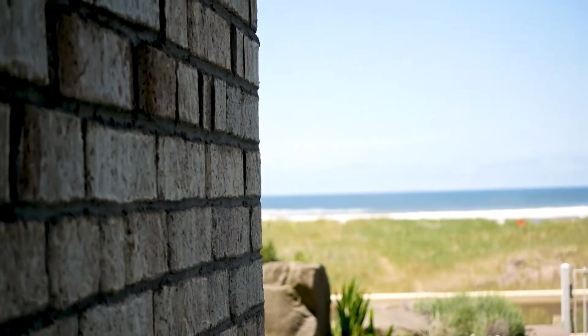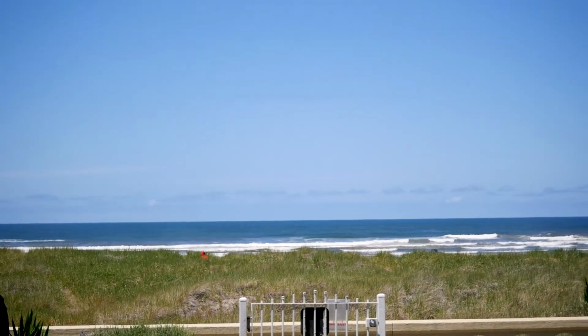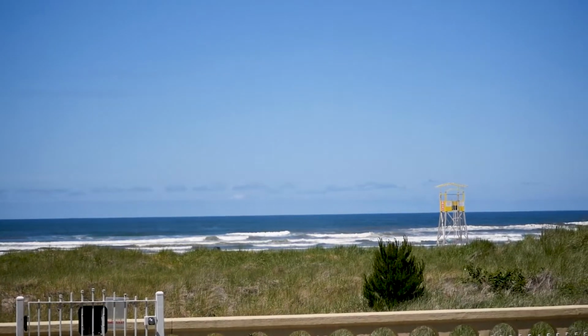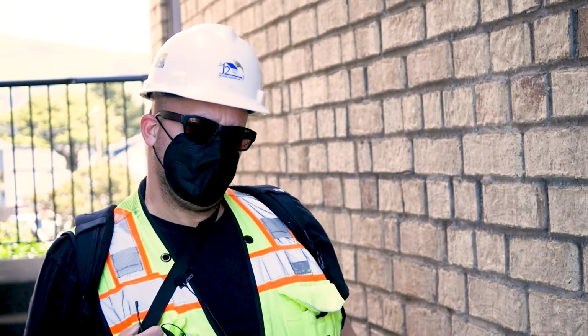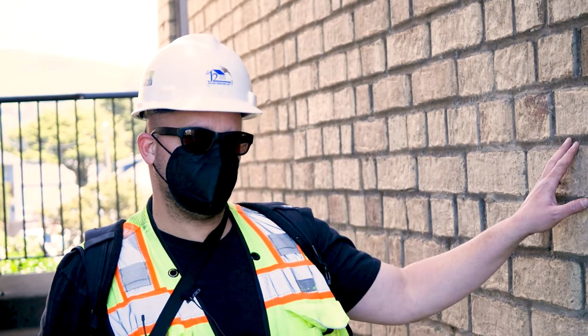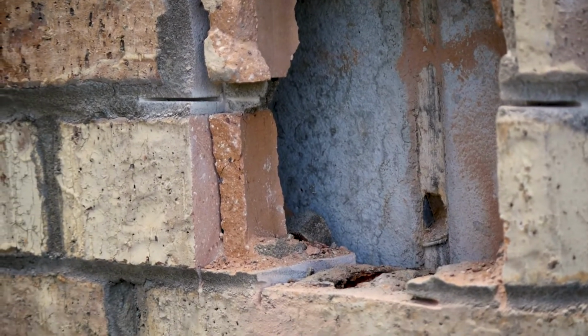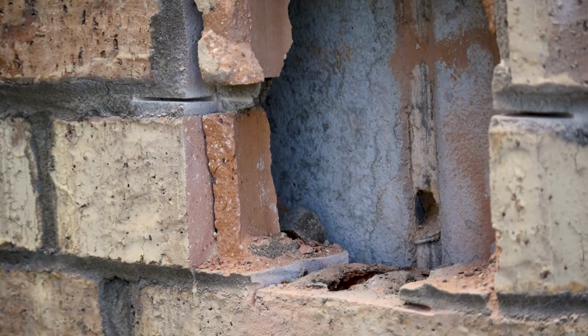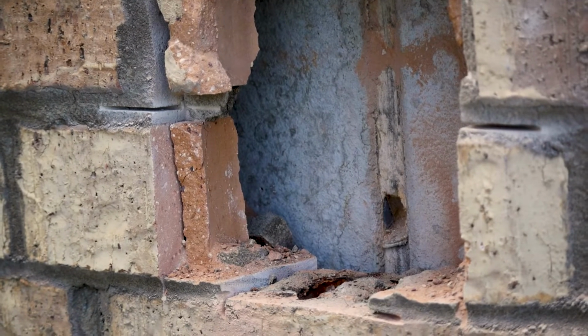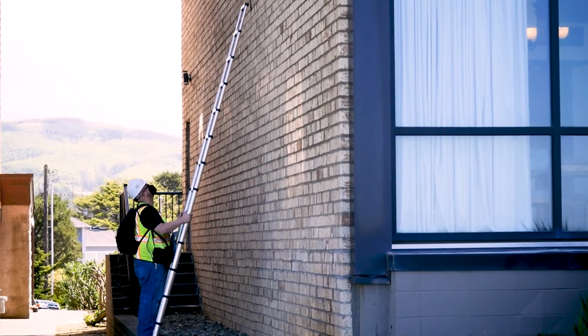Historically, older brick that was soft clay brick required a very soft mortar, and it performed very well. The old mortar had a lot of hydrated lime putty in it, and when you would get minute cracks or it would disbond from the brick, that lime putty, when resaturated, fills the interstitial spaces and actually fixes small cracks and fissures in the mortar. So it's self-healing and self-repairing mortar joints. Unfortunately, that is not the type of mortar that we use anymore.